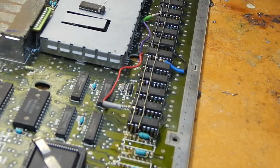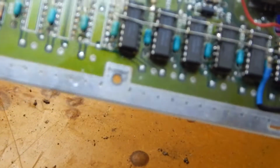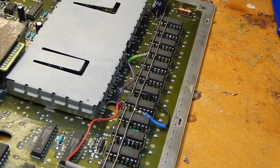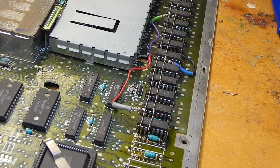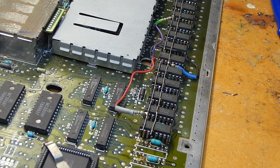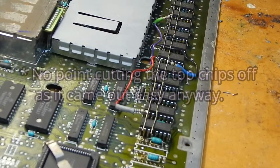That will unfortunately chug away for quite a while. So now we have the chip out. Now I was a little bit against trying to unsolder them straight from the top when they're still actually soldered on the bottom, but in this case, because it's so hot anyway, I think they will all come out without too much bother. So let's give that one a try.